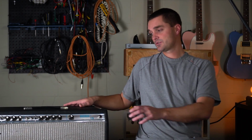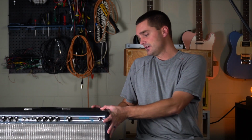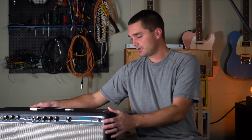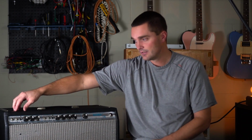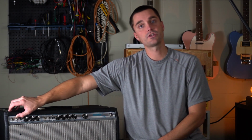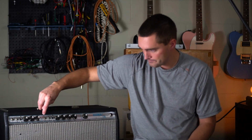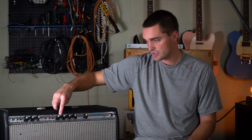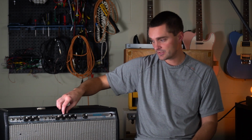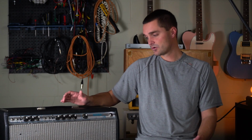It's a pretty heavy amp just on initial inspection. It's on rollers, which is really quite nice. Looking at the front controls of the amp, we've got the classic two channels. We've got the bass normal channel on this side, which has deep, volume, treble, bass. Then this other channel over here is the bass studio channel that also has two inputs with a bright switch, volume, treble, middle, bass, so a little bit extra EQ here with the middle control. And then we've got a master volume, so certainly putting it in the Silverface era of Fender with that control as a dead giveaway.